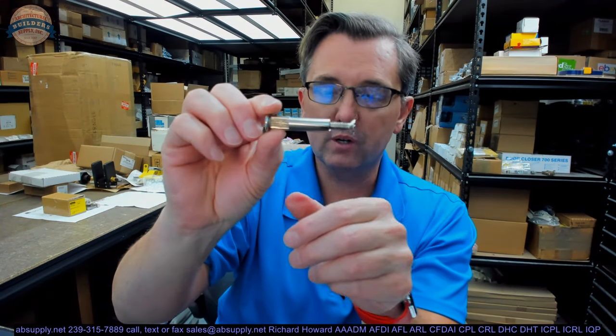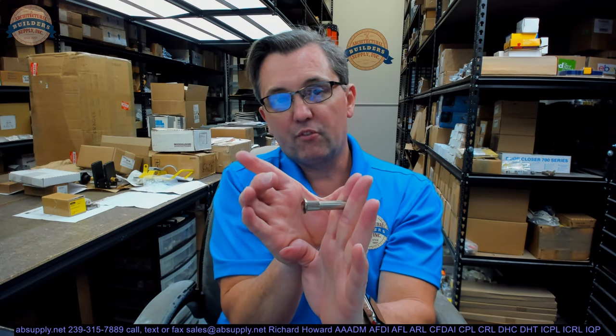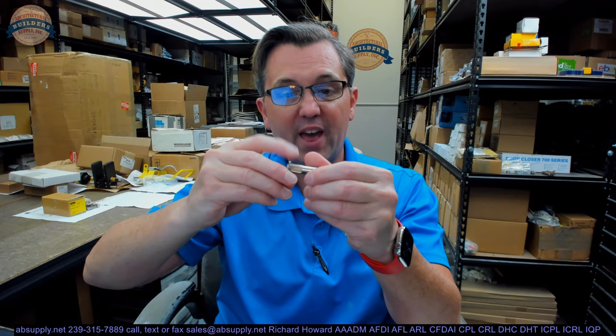What makes these specifically engineered for the application is when you drill your three-eighths hole on the outside and then a quarter inch on the inside — maybe one wire size larger on the inside. You don't want the outside overdrilled. The underside of the head to the end dimension is right for when you insert the female side through the exterior, opposite the door closer side. This shoulder of the bolt is going to make contact with the inside face of the steel, so that when you tighten the bolt, the shoulder — which is why you're drilling two different diameter holes, quarter inch here and three-eighths here — will prevent you from crushing that door skin in. These splines are meant to prevent the bolt from rotating in that hole when tightening. You'll have to tap it in gently.